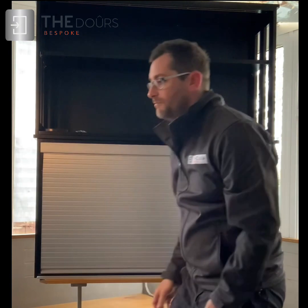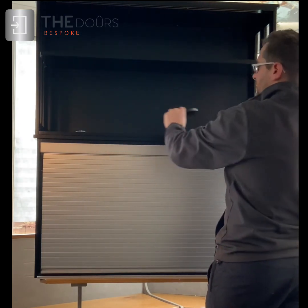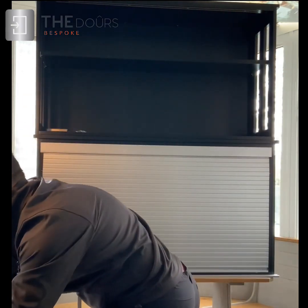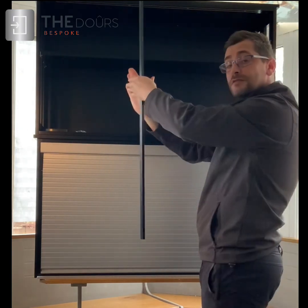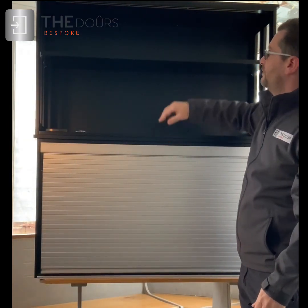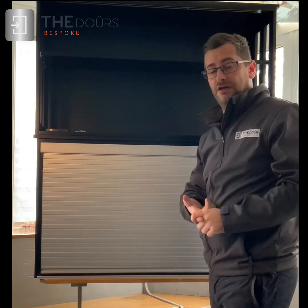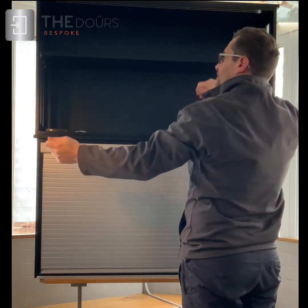You also have the option of two doors sliding and meeting together. If you have a metre-wide unit with a pillar in the middle, you could have a spiral on each side with top and bottom track, and slide two doors up against the pillar. Alternatively, with the spiral and straight track in front across the full width, two doors can slide and meet in the middle. If you use all four spirals on a unit that's half a metre high by a metre wide, you'd still have half a door left, so purchasing some extra parts lets you do another unit with the original half of the door.